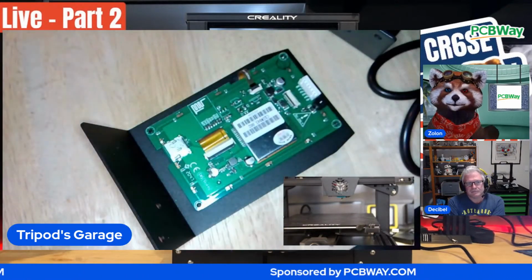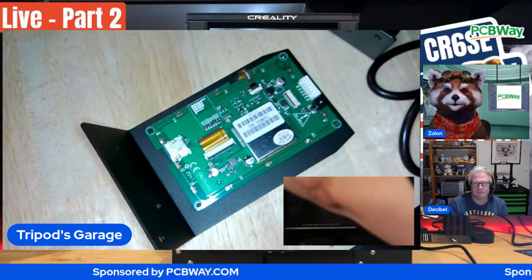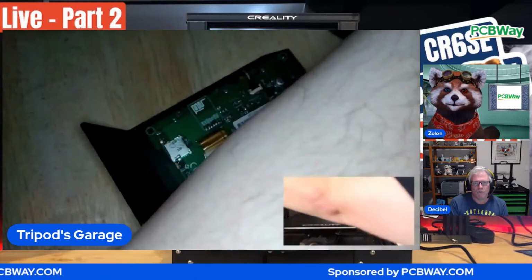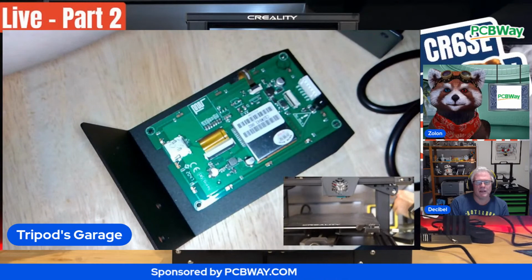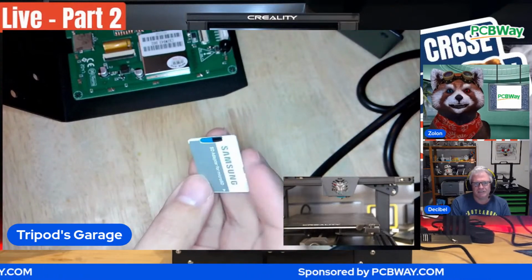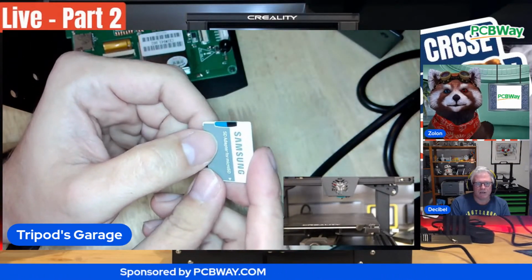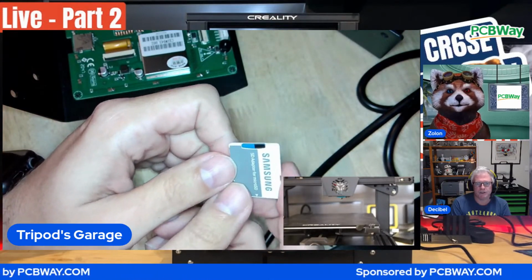Is that the one where one of the wires of the switch was rubbing against the frame or something? It was just the inside shorting out. Yeah, the rocker switch itself, there was just a thin metal bend to make the contacts, and that was staying and shorting. Oh wow! So it was a reed switch and not an actual switch. Correct. It was just a rotary contactor, a really cheap, poor quality switch.